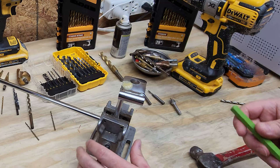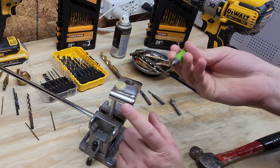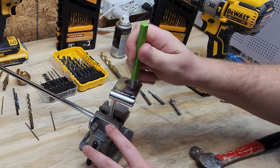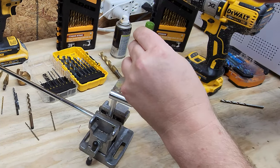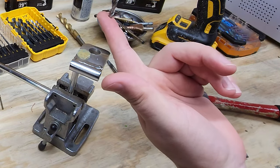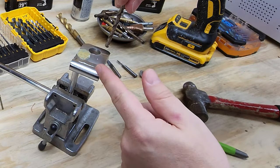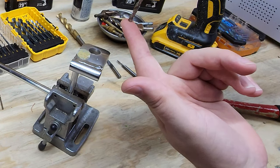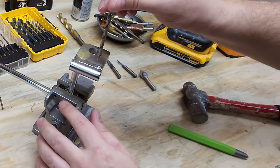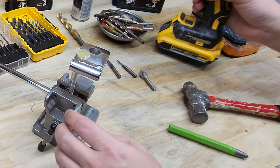One of the things I want to point out is that when you are going to drill a work piece, you always want to try and center punch it first. You have a piece of metal that you are spinning, and as you spin it, it wants to walk either with the angle of the work piece or because of the rotational force of the bit. So we want to give it a place to start — right there. Let's go ahead and take a look.